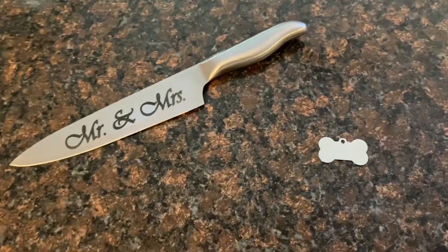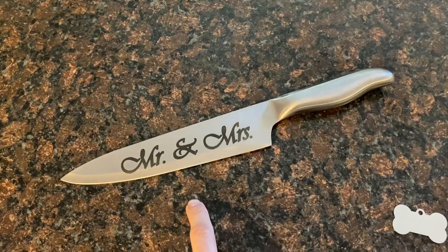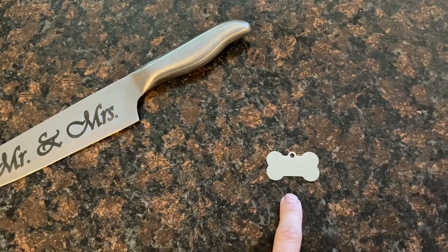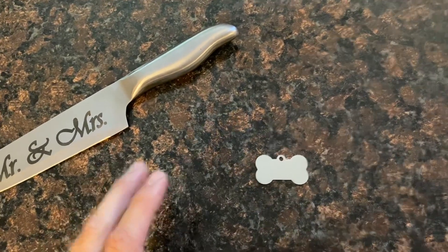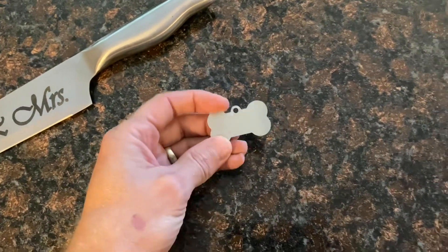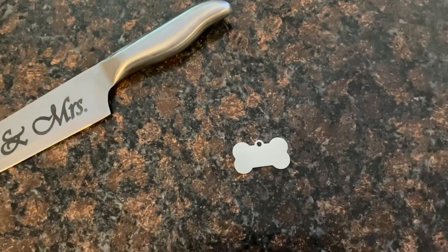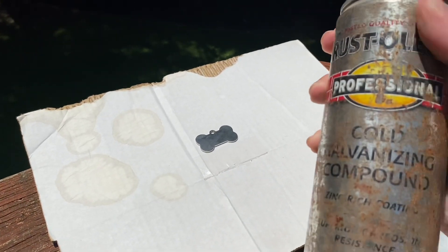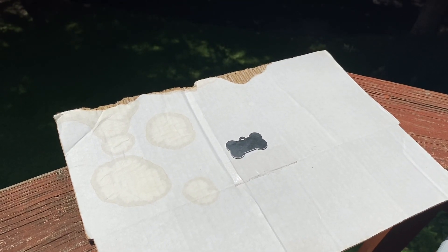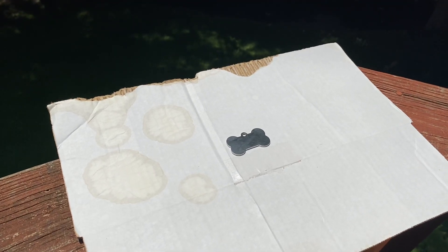Today we're actually going to be doing the dog tag. This is another project that I did a couple of days ago using the same method, but I wanted to do something a little smaller today and actually show you the full layout on how this actually works. This is still stainless steel just like this, but we're going to coat it with the cold galvanized. When you're spraying it using the cold galvanized compound, you don't want to spray it too heavy and you don't want to spray it too light either — just a good even coat. I've just been putting one coat and it's been working out well.